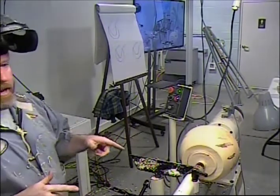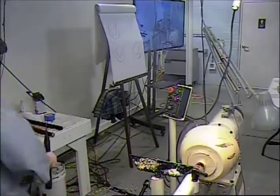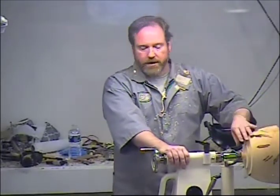Any questions on that? Good. You guys are all experts, right? The only reason I'm going with a larger tenon right now, yes, the chuck jaws, again, steel versus wood, the steel's going to win. You're going to grip way in there. But I would make my tenon larger because I know after this is dry and I return it, I'm going to have to true up that tenon, which is going to make it smaller.